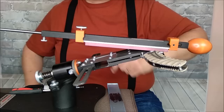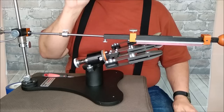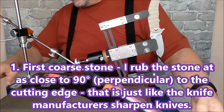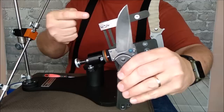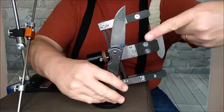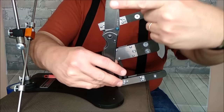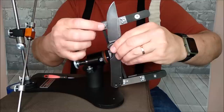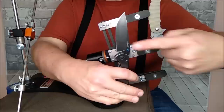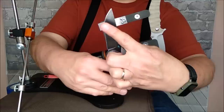This next part I've mentioned in several videos. I adjust the angle I attack with each stone. I go straight up and down — perpendicular to the edge — with my first stone. On the next grit I change the angle a little and go up on a slight diagonal. The next grit after that I go on the opposite diagonal. The reason is you want to remove the scratches that your sharpening stones put in — the coarser the grit, the bigger the scratches, so you don't want to go exactly perpendicular with every single grit or the deep scratches won't get removed.